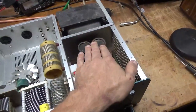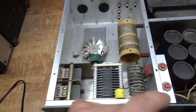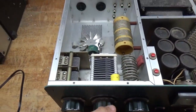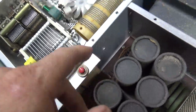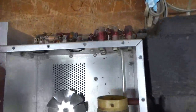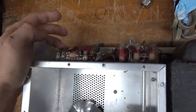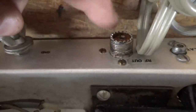It needs the Harbach kit, which I have here. I'm going to change the plate blocking cap. Band switches look good. Air variables look good. Some of the diodes had blown apart and he had put diodes underneath — I'll show those. Everything back here looks okay. I'm going to change the grid loading resistors and the mica caps.